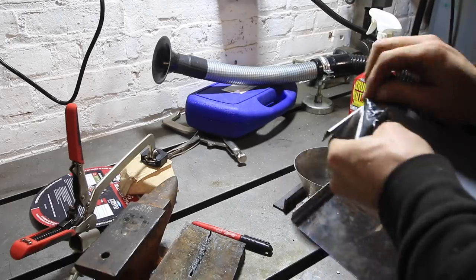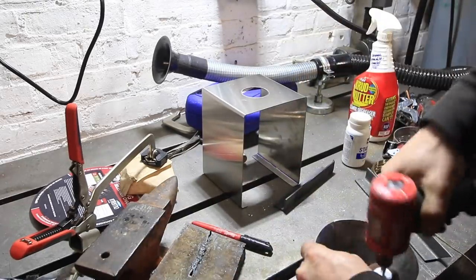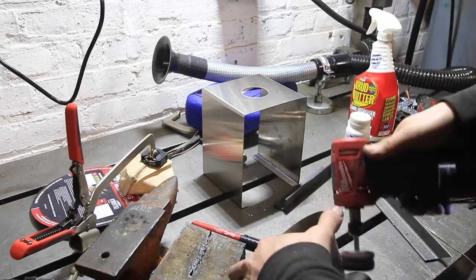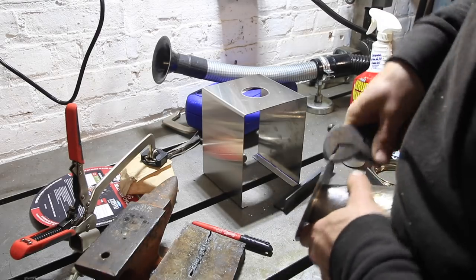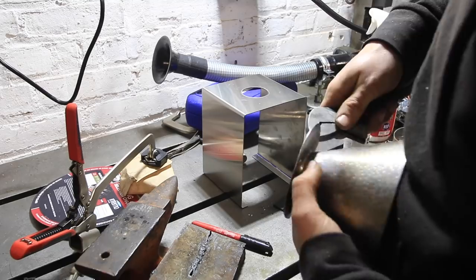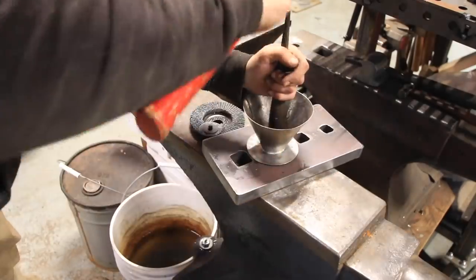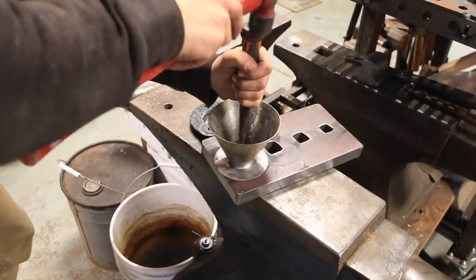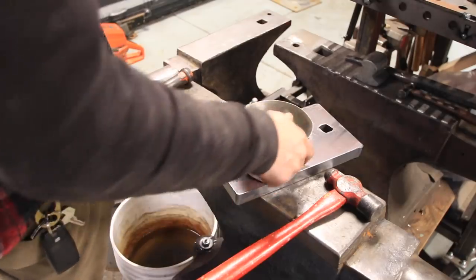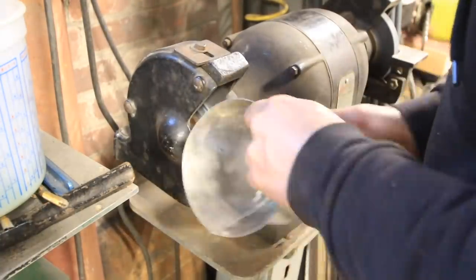I can pull the plastic protecting off of this stainless little frame — that thing's good to go. Then a little bit of cleanup on the funnel itself, kind of the same process: going over to the wire wheel, using the little multi-purpose sander, getting in all the nooks and crannies, cleaning it up and polishing it. The only other thing I had to do was the bottom of the flat plate had warped a little bit from the heat, so I just grabbed an adjustable wrench and kind of wrenched it back to get it a little bit flat. The last thing I noticed was that the coffee wasn't dripping straight out the bottom, so I took a punch and actually dimpled the bottom of the dripper. This makes the surface tension of the coffee drip straight out the bottom instead of rolling around the sides — that was a nice little solution and it worked out really well.